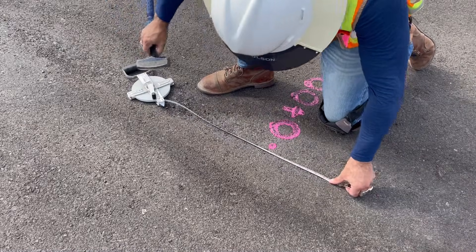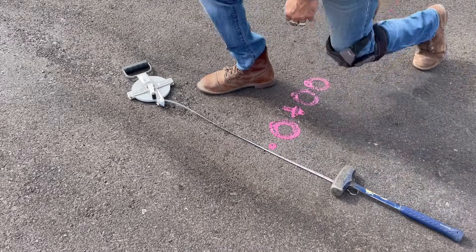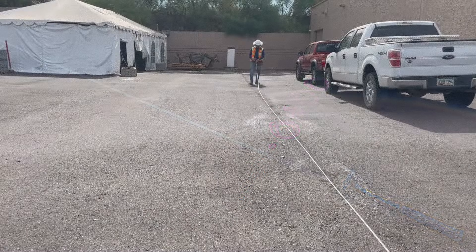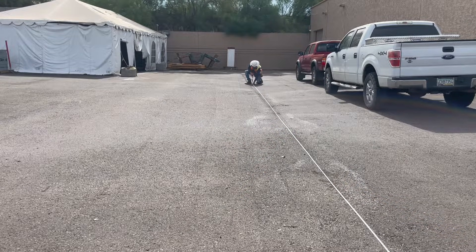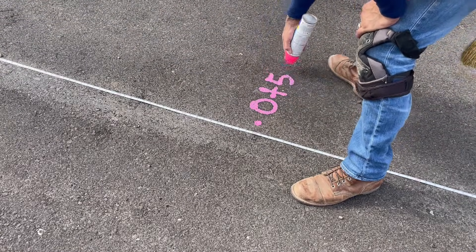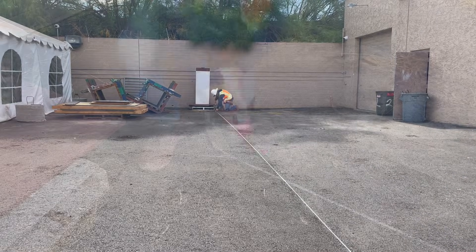You'll need a calibrated steel tape at least 100 feet long to set up this baseline. If you're working alone, secure one end so that the zero on your tape coincides with the mark you've created. Extending the tape in line to create my baseline, I'll mark out 50 feet as the next interval. Then I'll continue to roll the tape out to 100 feet and create my final mark.